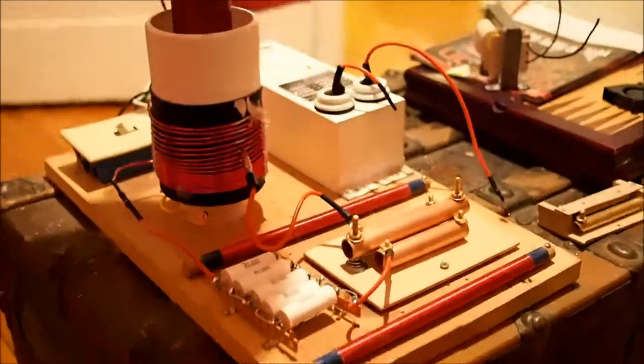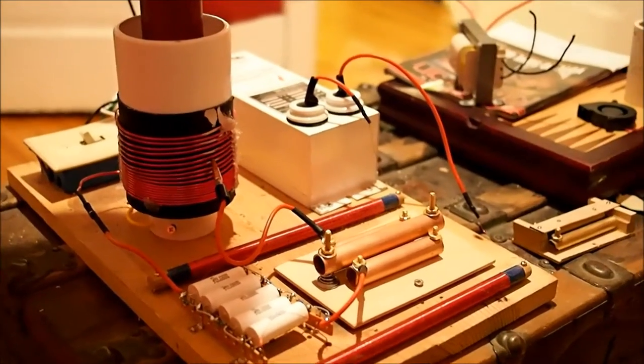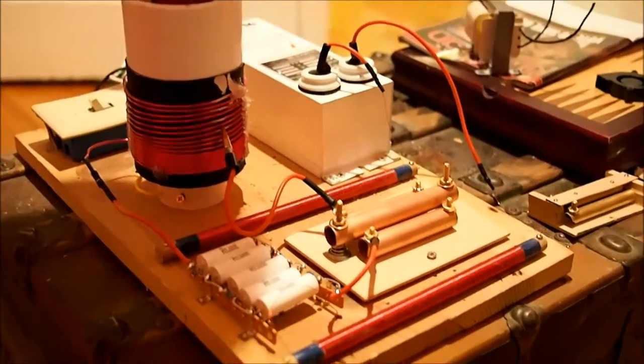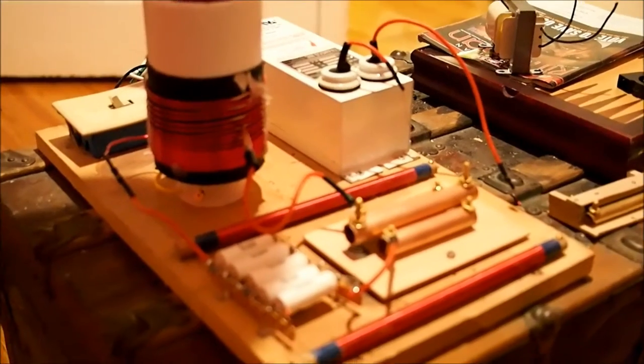One final note, I will be shielding both the spark gap and the capacitors. I've got this black Kydex sheeting. It works pretty good for that kind of stuff. But we shield the spark gap because it emits a good amount of hard ultraviolet radiation, which is really bad